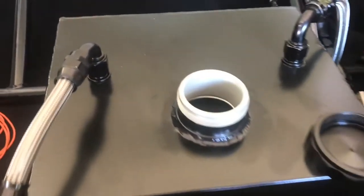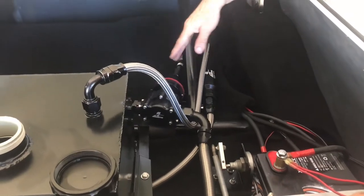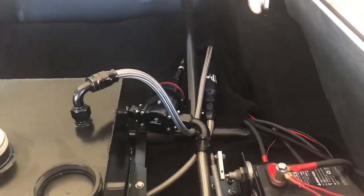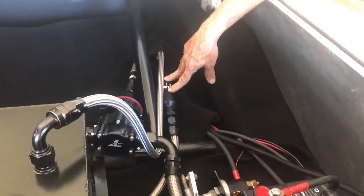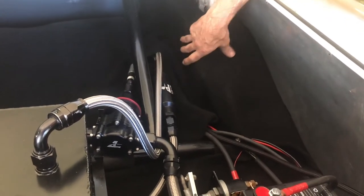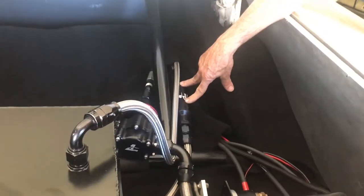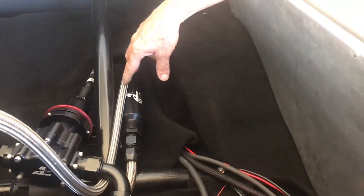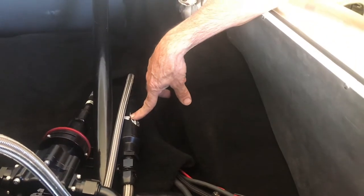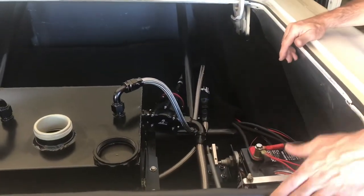We keep the fuel full to keep the moisture out. What we're going to do now is drain everything. The fuel pump is cable driven, filter and all lines are mounted back here. We're going to drain the fluid out, and so we don't have to do this every time, they make a filter that has a shutoff valve on it. We're going to put a number 10 and a number 12 shutoff in, so all we have to do is shut the fuel off, leave the tank full, and just take the injectors out. But for now we're going to have to drain everything out and take the injectors out.